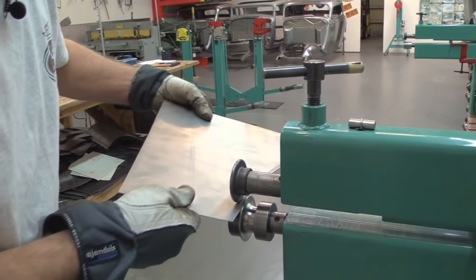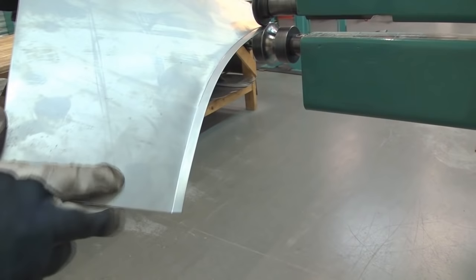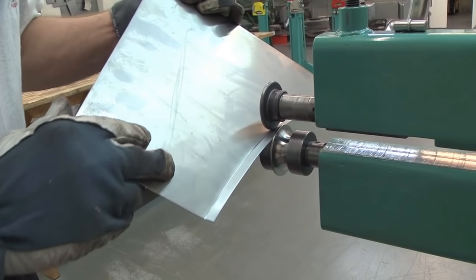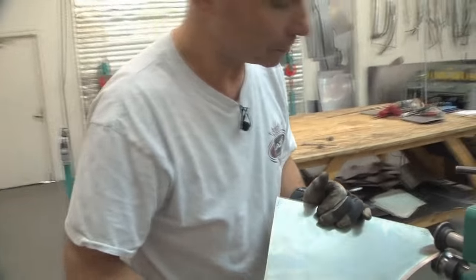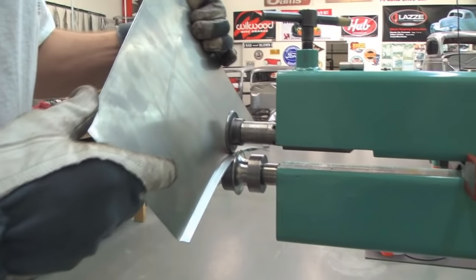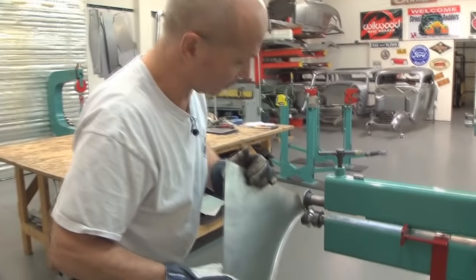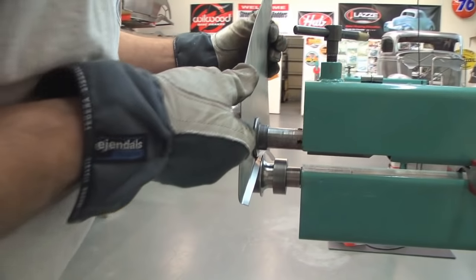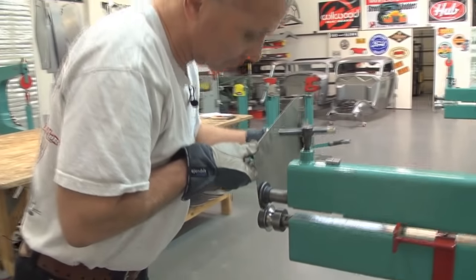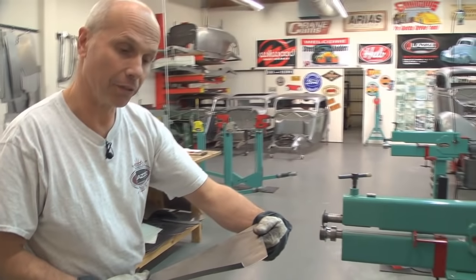I'm going to do this in probably about four steps. If you have a speed control on your machine you can go any speed you want. The more you get used to the bead roller the faster you can go. Don't fight with the machine - the machine does the job. Just keep it constantly where it should be and the touching point is down there. Now we have 90 degrees. I'm going to switch the bottom die so I can bend it 45 degrees more.